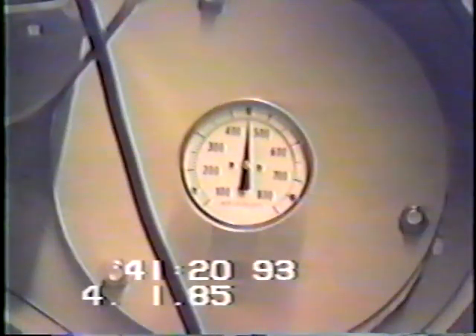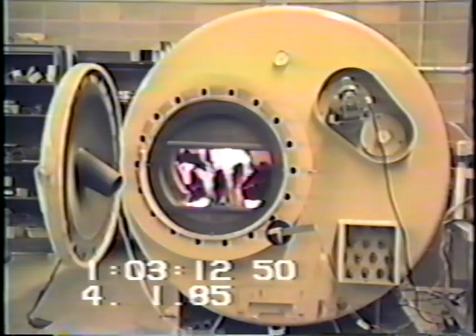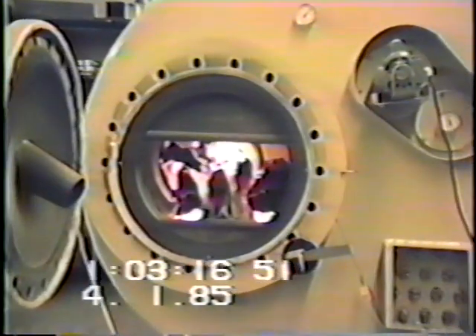At this time of the burn we are operating at our absolute peak performance. Our exhaust temperature is about 450 degrees. You'll notice at this point we're going to raise about 8 degrees — did you notice that jump? — in a matter of about 13 or 14 minutes. When that second load is put in and those temperatures are reached, it's very easy to rapidly increase the storage tank's temperature.